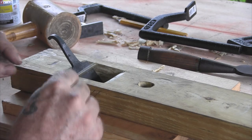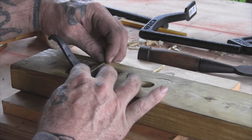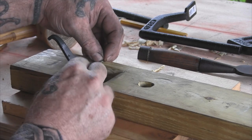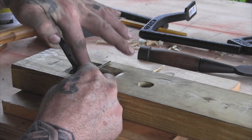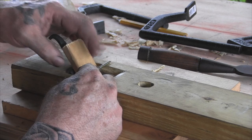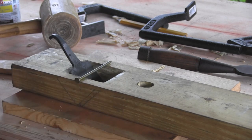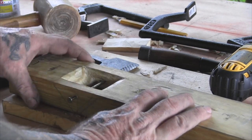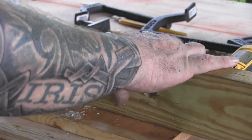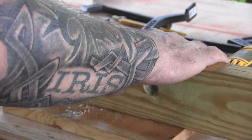The next step is to see where we want our cross piece to go through. I'm just going to need a nail — a 16-penny nail — and just drill a hole through this. The bar will be down here below, and then you'll put a wedge in there made out of wood to hold that blade where you want it. I only drilled through one side because I wanted it to be stuck in there, so now I'm going to pound it in and just hope I don't split my wood.